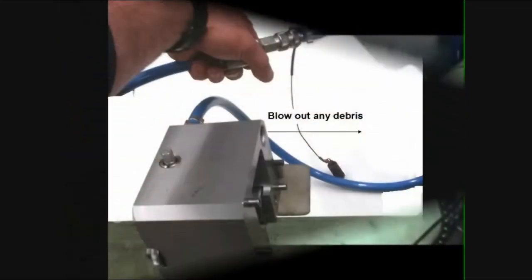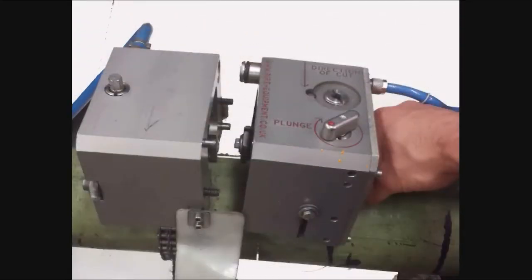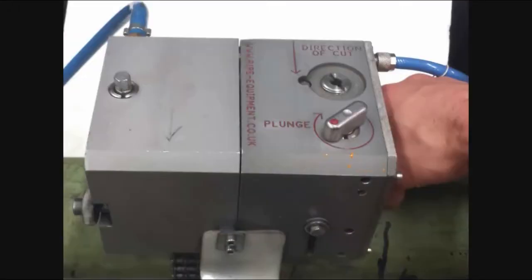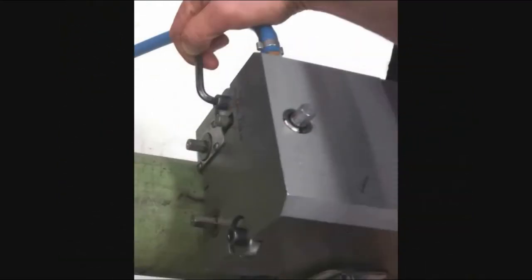Bring the circumferential module to the 12 o'clock position. Connect the dead man handle to the circumferential module. Before fastening the cutter module, quickly depress and release the dead man handle to blow out any debris that may remain in the housing or in the airline. Then connect the cutter module, fit with the blade, into the circumferential module. Tighten the thumb screws until moderate resistance is felt.